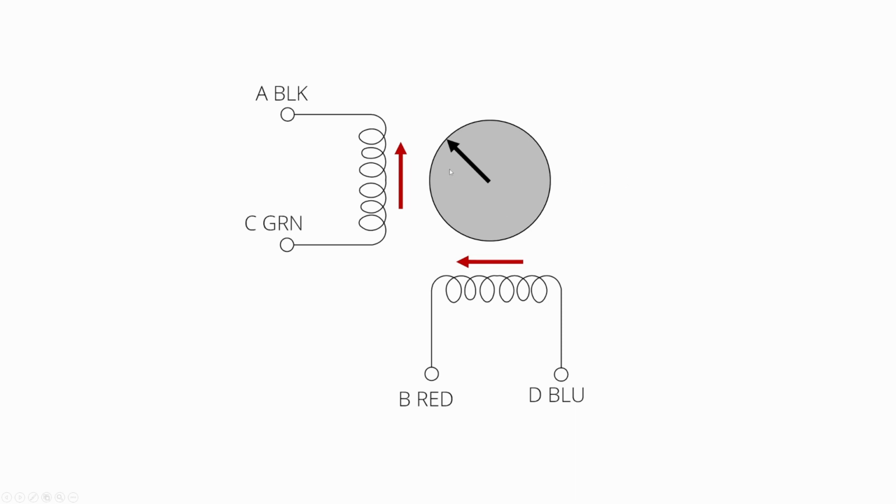Similarly, we can keep this magnetic field active, and we can switch this one, and that will move the magnetic field over into this angle because this positive vector plus the vector over to the right equals this 45-degree angle. And we can keep on switching one phase at a time in order to drive the magnetic field in rotation. And so in this way, we're never losing torque. We're always having some torque or some magnetic field applied. So this is what's happening in the test we just did, where both phases are on or off in a positive or negative direction. There is never a 0 point.